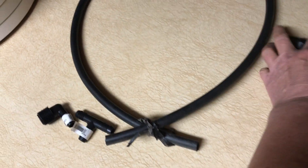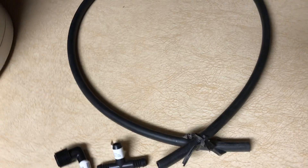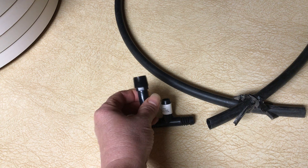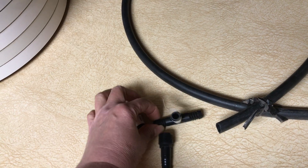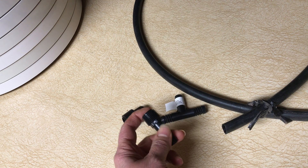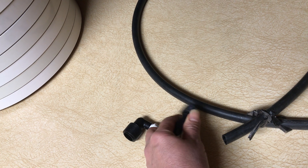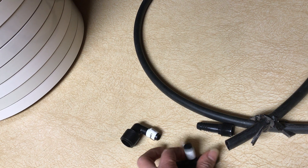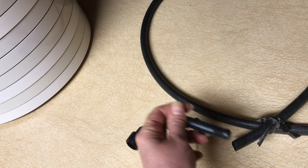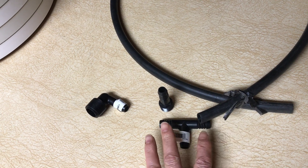Then I have another elbow right there. You can turn it and have the sprinkler head coming straight up if it's deep enough — either three-quarter or half inch. You can have it laying at an angle one way or the other — it just depends on how deep your PVC is. That way you can stick a smaller sprinkler head on top if you have it straight, or you can have one coming out of the sprinkler here and one coming up on this side, then run funny pipe and have one come up at the new location. Just play with it before you stick any parts together.